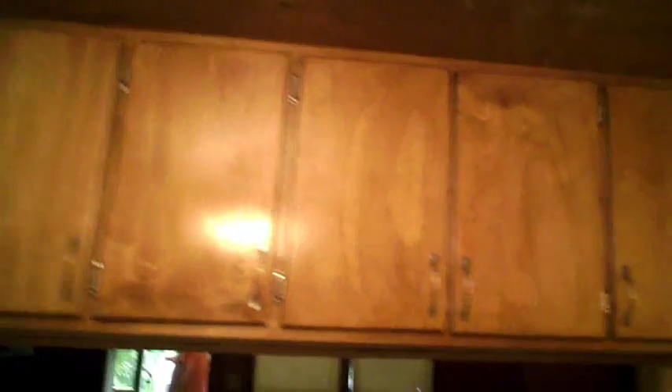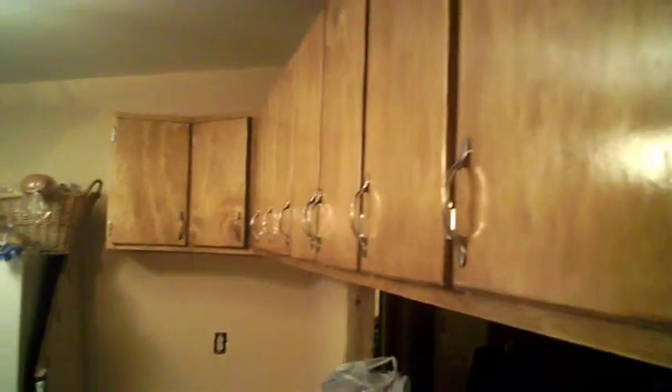Man hours: sanding. Building the cabinet didn't take me that long at all — it's the sanding, polyurethane, sanding. I stain, then sand, then stain again, then polyurethane, then sand, then do two more coats of polyurethane. But it's a glass-like finish that is just smooth to the touch, and I like it. I think it'll protect the cabinet well. Underneath the cabinet I just put one coat of stain — you're not going to see that much. The cabinet is finished. If I was to do it again, I can see where I puttied the brads — I would sand that better.